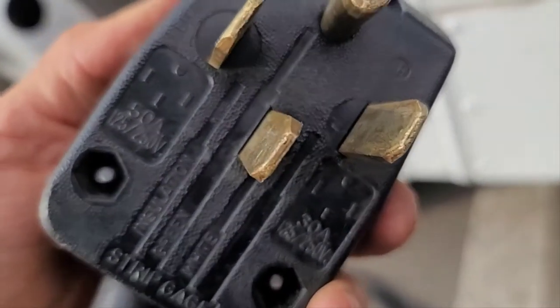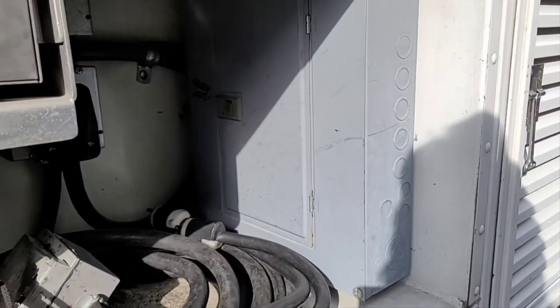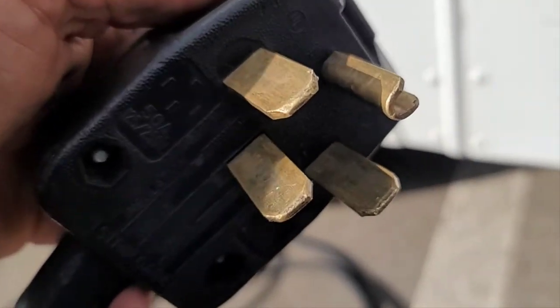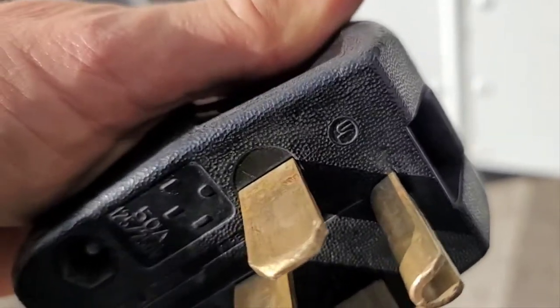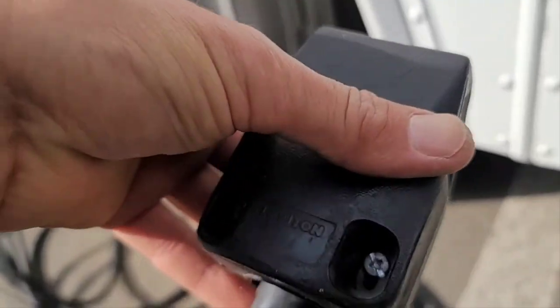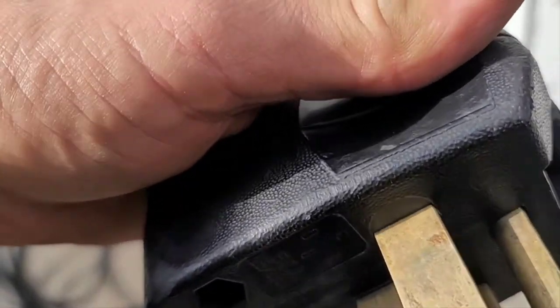If you're a professional homeowner, turn off all the breakers on whatever you're plugging in anytime you do a repair. Then turn on the cheapest thing first, like your lights — wait 60 seconds, make sure they didn't blow up, then turn on the next thing. What you turn on last is your refrigeration, air conditioners, freezers — anything that would be really expensive to repair.